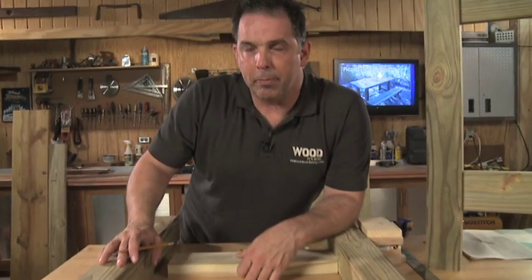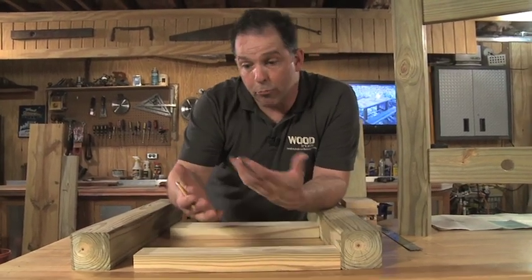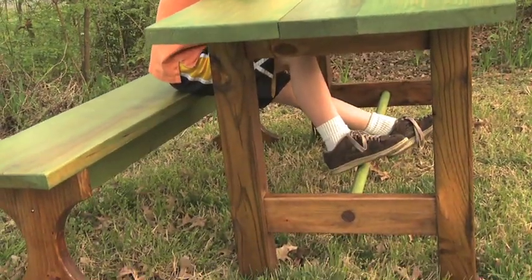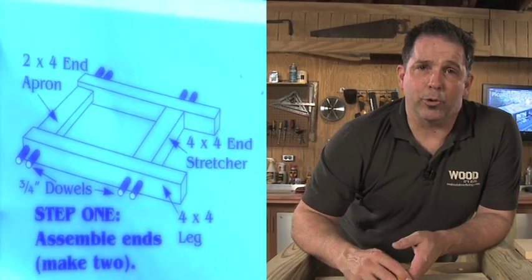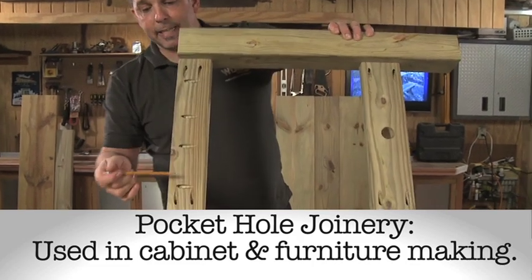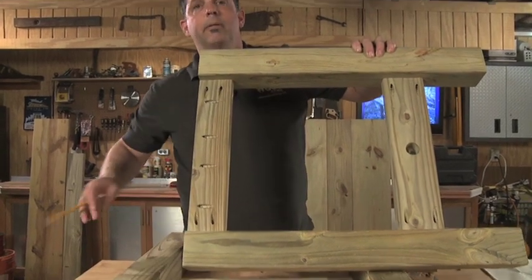Let's talk about a couple of things before we put it all together. Number one, we're going to soften the edges of the apron and the stretcher. I'm only going to soften the bottom two edges of the apron, because the other side will obviously be butted against the bottom of the top of the table. On the stretcher itself, I'm going to soften all four edges since they'll all be visible. I also need to drill a hole in the center of this stretcher for the dowel that will act as a footrest along the bottom of the table. Now, the plans call for doweled joints — a very strong joint, but a very visible joint. I went 180 degrees off. These are pocket holes — almost invisible joints used a lot in cabinet making and fine furniture.